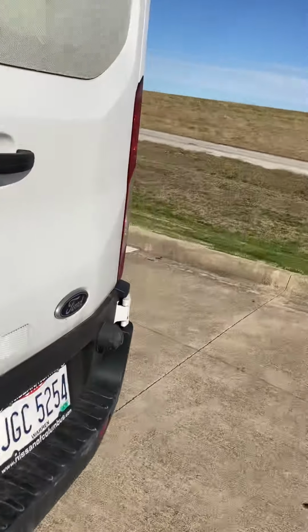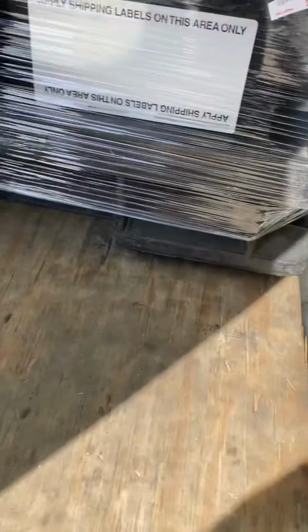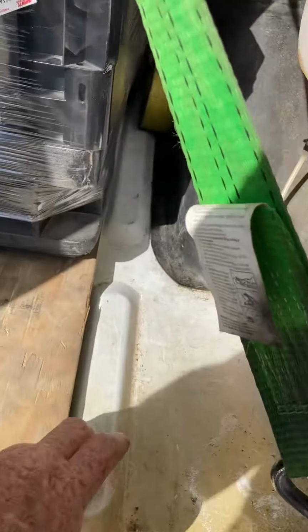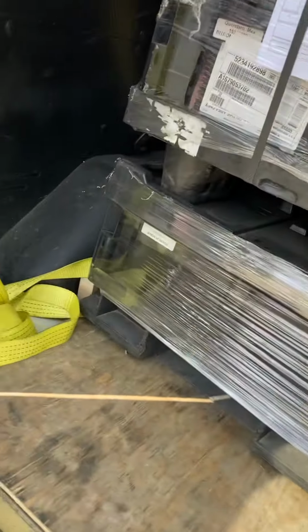I mean, this here is just a floating piece of wood. This is not attached down in any way, shape, or form. I don't need it to be strapped down. Because, A, you're going to drill it into this metal. There's a problem. This is going to rip the screws right out here like a zipper. Zip out is going to come anyway.